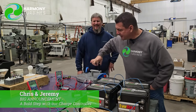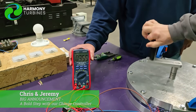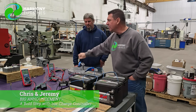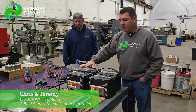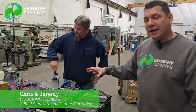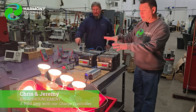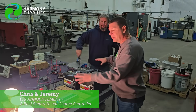I'm spinning this with two fingers right now and actually charging the batteries. I am charging the batteries at 48 volts and putting half an amp into it. It's hard to hang on to with two fingers, but that's crazy — we've never, ever had anything even close to this with an electronic solution. This is quite literally an analog solution. The batteries themselves are the biggest filter you could ever want. They're taking straight rectified DC power and putting it in. What this means is we can take power off of our system on the back end and he doesn't feel any change on the front end at all. This is the entire use case right here — battery bank, charge capability, filtering — everything is being done by this incredibly simple system.